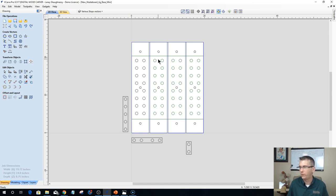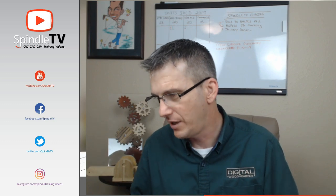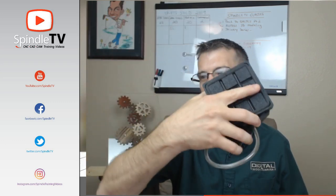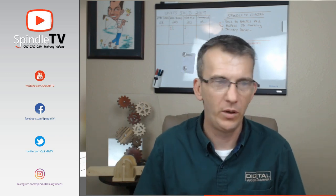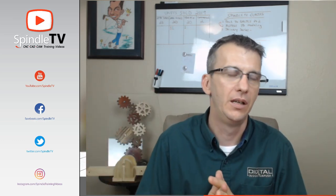Yeah, Tim, it's great for the 2440. It's great for all CNC. It's just a nice waste board. It's versatile. Mechanical clamping. And let's get out of the Vectric software as I say my goodbyes to you. It's great for mechanical clamping, whether you have these little edge hold downs or rocker hold downs, or we use wooden hold downs. It's great for when you're using the fences and cams, for cam clamping. There's other mechanical clamps that can fit into the T-tracks, and then of course, like I said, vacuum clamping, if you use vacuum pods, there's all kinds of versatility in there. Double-sided tape, hot glue, all that wonderful stuff, because after all, it's still a waste board, right? Even though it's a jig as well.